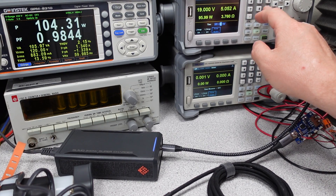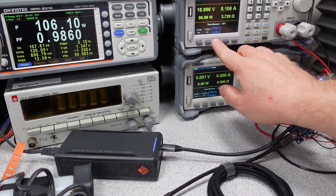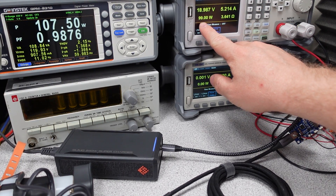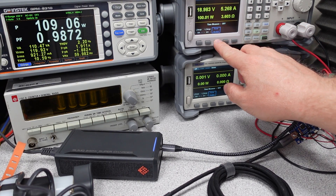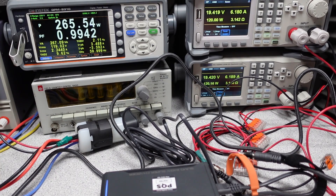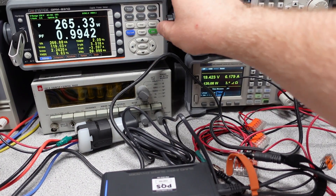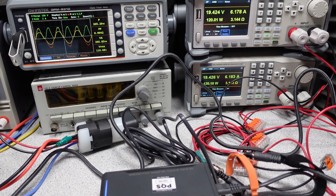The cost for this adapter is about $140. This is not terrible for this level of output power, although for that money I expect a safety listing, which this device lacks. The power adapter turned off when at rated load of 240 watts. The USB ports shut off at about 98 to 100 watts. There is no headroom on this device — the ports shut down at the rated power level. I'd like to see a little room here, but there are other issues.